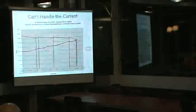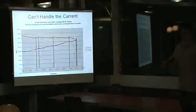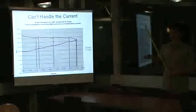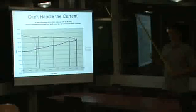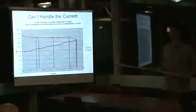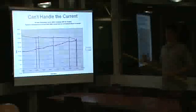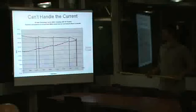So we faced a lot of headaches like that. There's another common problem, which is that the battery management circuit can only handle so much current, and they have to design it, the switches that turn the current on and off, to handle the current that's flowing through the e-bike. So we would always specify that we need a battery that can deliver 20 amps or 30 amps or 40 amps, whatever a bicycle needed.